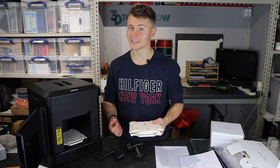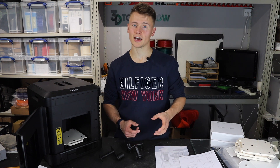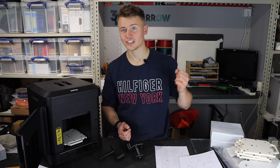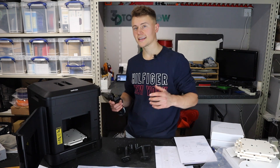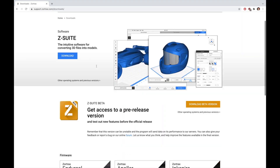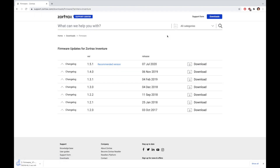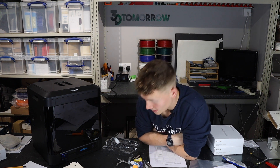You won't be losing temperature in the chamber if you can quickly change out your prints, which is always nice. It's always annoying when the bed's hot and stuck to the print — you start jamming at it and risk breaking your glass bed plate. You won't have to do that with this one. So the next step is to get the printer plugged in and switched on. On first switch-on you'll need to add the latest firmware: go to support.zortrax.com downloads, click Inventure, download the firmware, put it on your SD card, insert it back in the printer, then turn it off and back on again. It's now found the file and done the update.